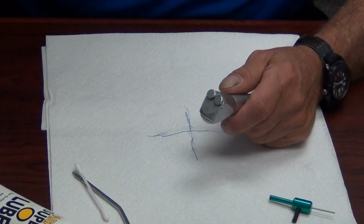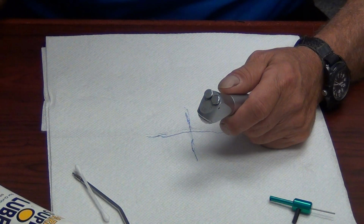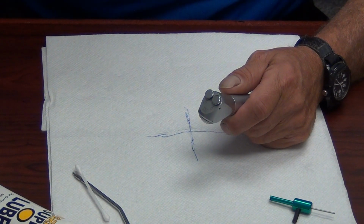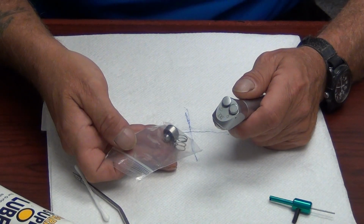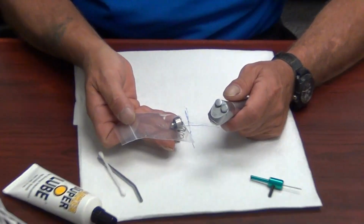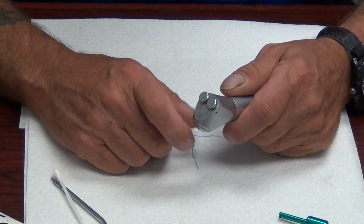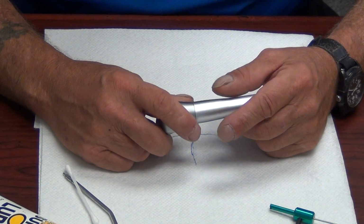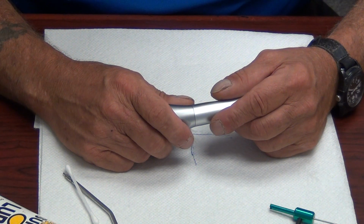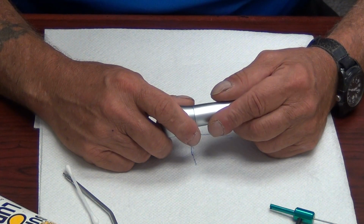You should stock some basic syringe parts: the syringe repair kit from DCI, which is part number 3066, and the Quick Connect tip holder assembly. These items should be stocked, guys. In the event that you don't have these when you have a free service to do, don't worry. If you've got a syringe in your truck on your delivery unit, you can actually use the parts off of that syringe to repair this syringe. So no need to panic.